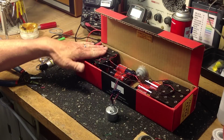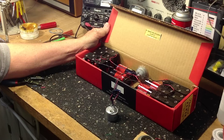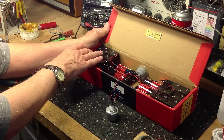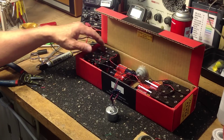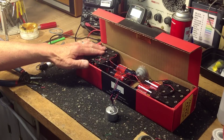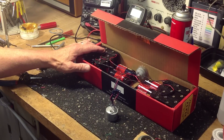The advantage of using a power supply with 60 AA batteries is that it will last about 400 hours of playing time depending on how you use your radio. You can substitute this for 10 9-volt cells wired in series and that will play from 40 to 60 hours. It will be lighter as well, but it's a trade-off over whether you want longer playing time or the convenience of not having to replace 60 AA cells when they finally go bad.